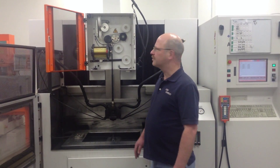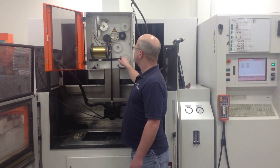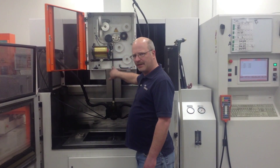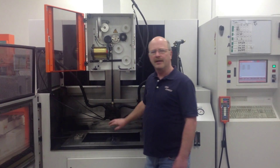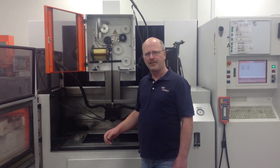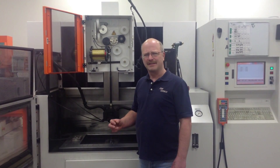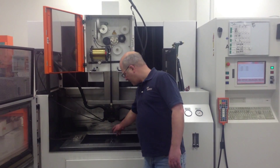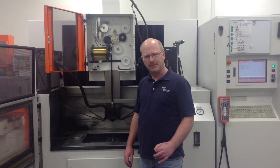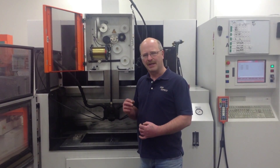Let's take a little closer look at how the wire goes through the machine. The wire comes on a spool like this and goes through a series of pulleys. These pulleys apply tension to the wire. The wire then travels down this tube to what we call the upper head. In the upper head there's a contact that touches the wire and delivers electricity to the wire. Right below that there's a diamond guide. This diamond guide has a small hole in it that's precisely the same size as the wire. The wire then travels down to the lower head and first goes through another diamond guide that's precisely the same size as the wire.